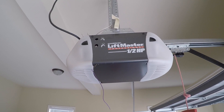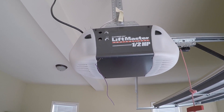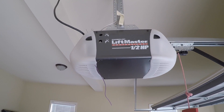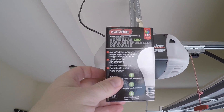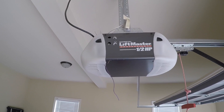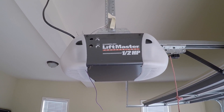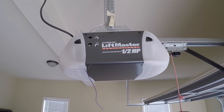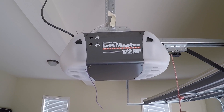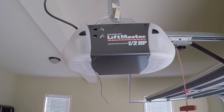Whenever you leave your house and try to close your garage, your garage door remotes do not work because the lights are illuminated on the motor up here. I have since found a solution and they are these Genie LED bulbs. Genie recognized the issue and created a bulb to put out a different frequency than most garage door openers. I say most because I'm testing this with a Chamberlain LiftMaster. I'm sure that they work with all Genie openers but not all openers work off the same frequency, so you will have to test it with yours.